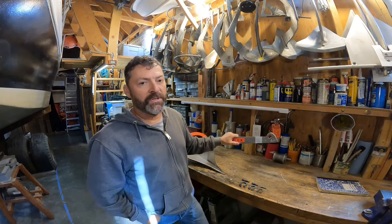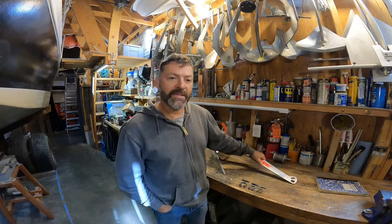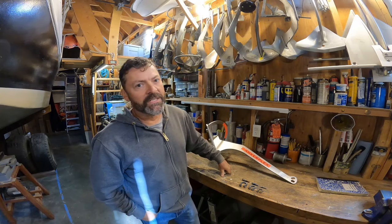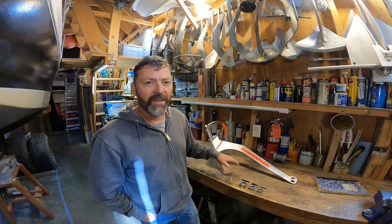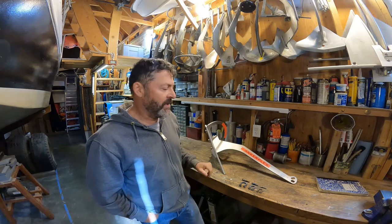So the anchor came out at 22 pounds on my scale, and when in the setting position, the tip came out at 7 pounds for a tip to total weight ratio in the low 30%. That puts it about middle of the pack for the other anchors.